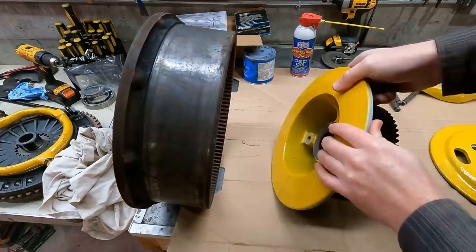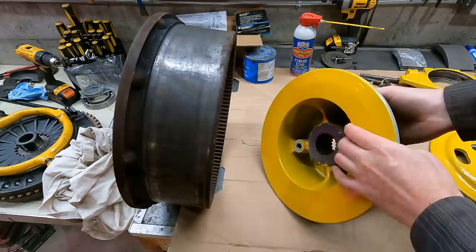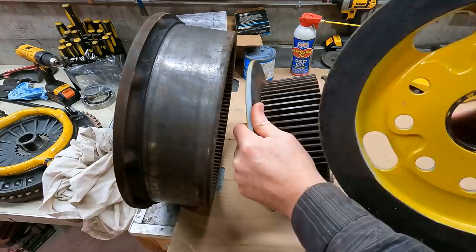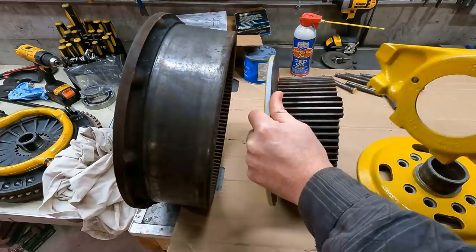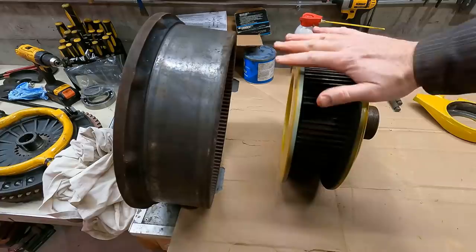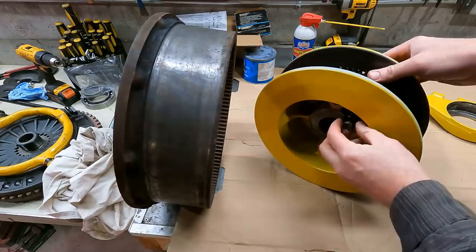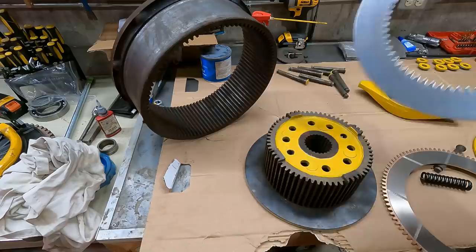The first thing you'll notice is that there are notches cut in for the splines of the bevel shaft. Once this is pressed on, this part is completely fixed — it cannot move on the bevel shaft. The other part does not have those notches cut in, because it gets pulled out by this throwout collar, which goes onto these threads, and your linkage pulls it out. These two are held together by springs — a stud goes through, the spring goes on, held by a retainer, keeping it compressed in its default state.